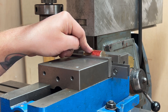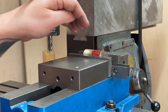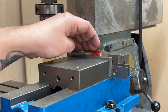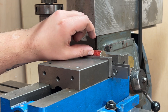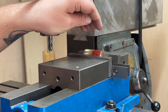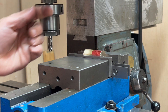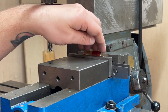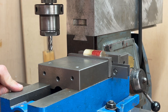I now need to make sure that when I take this down, I take it down by the same amount on both sides of an axis. The overall thickness of this part needs to be 540 thou, so I need to take 230 from this side and then 230 from the bottom side. That will be exactly right and this hole will be centred in that axis. That's the theory — let's see how it pans out.